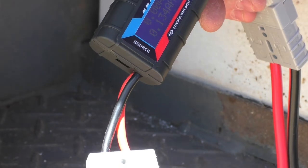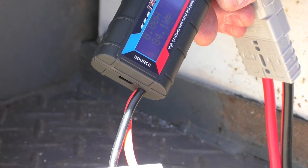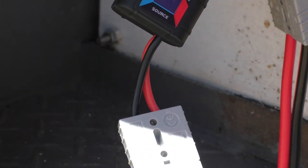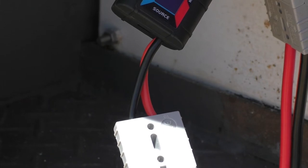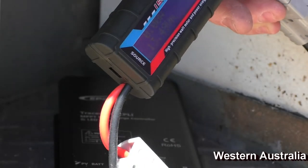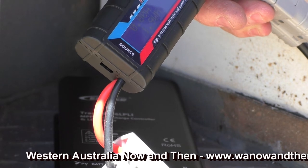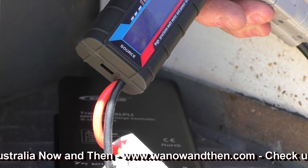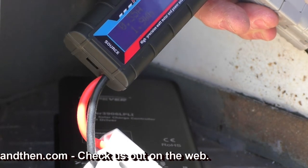Currently we have a nicely charged battery and the regulator is sending it a little bit of power then shutting it off. I would expect it not to be jumping around quite that much — I'd expect it to detect the battery voltage and stay low. But we're seeing zero watts, then 51 watts, then 16 watts — jumping around all over the place. Next we'll try the proper MPPT controller, and that's a lot more of what I would expect from a decent regulator. We're getting very little jumping around — it's detected the state of the battery, knows it's charged, and we're getting virtually zero amps, around 0.19 to 0.2. That other regulator is clearly not detecting the state of charge very well.